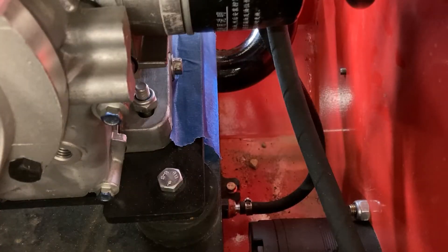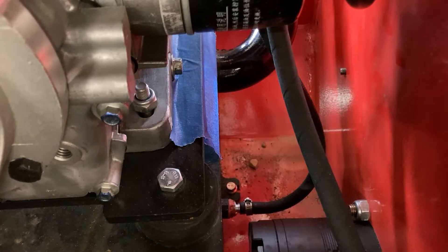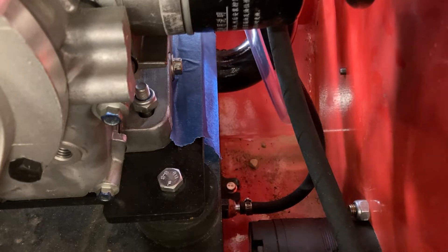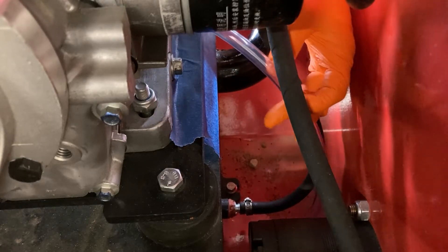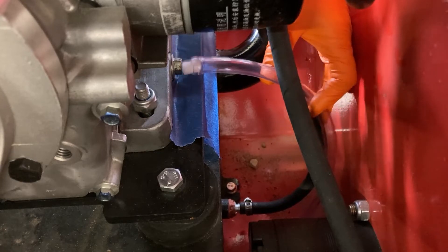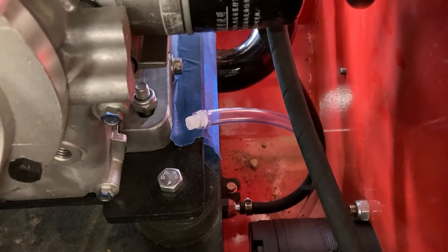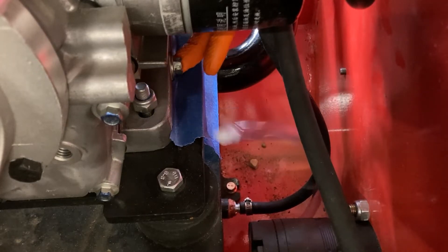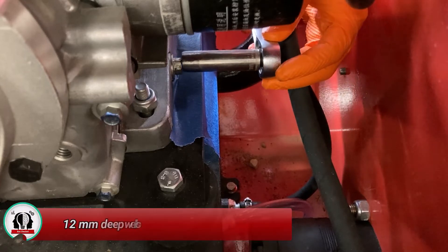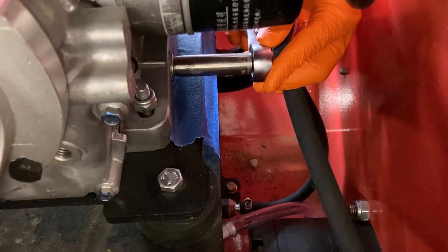You're looking at the view from pretty much where the muffler is, toward the oil drain plug. You can see the oil drain plug right there. I'm going to feed in this 3/8 tube that will hopefully help me drain cleanly, and position it off to the side. I do have my drain pan underneath. You can see the masking tape — that's not factory, I put that on there kind of like shingles just in case the tube doesn't work. I switched to a 12 millimeter deep socket, which fits a little better — the six inch extension was just a little too long.